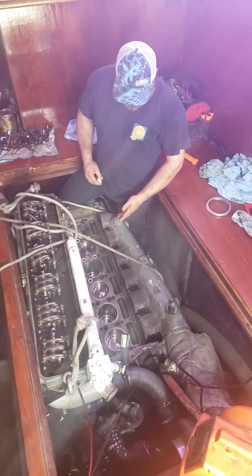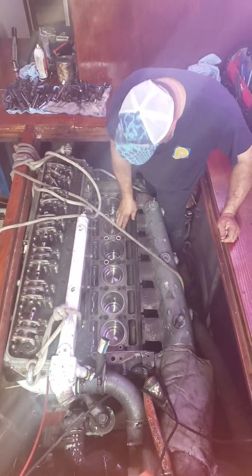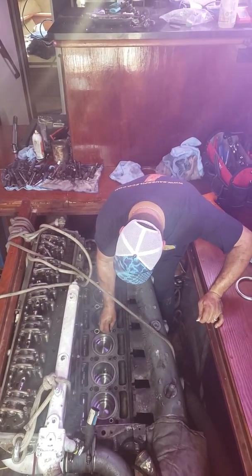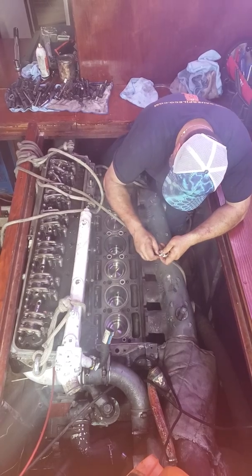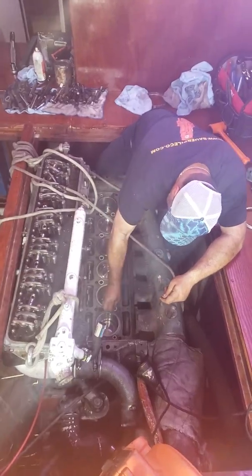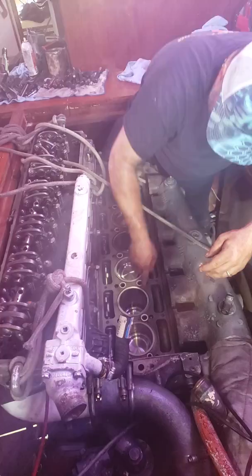As you can see right here, each cylinder has its own individual head gasket, which is basically this ring right here. What you do is just put this over, and the head is going to crush it a little bit — that'll become your head gasket. These are the individual water jacket seals. They're pretty easy. Just want to make sure all that's cleaned out. Just take a screwdriver and clean around the edges here, making sure you don't get anything down in here. We usually use lint-free cloths, the ones you wash your vehicle with.